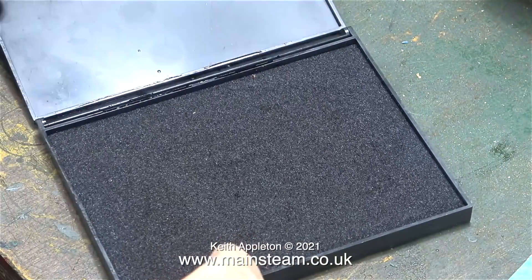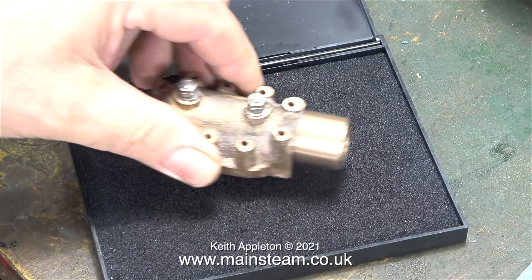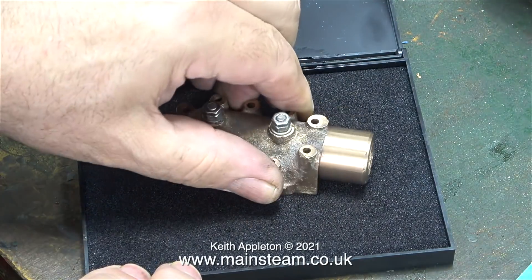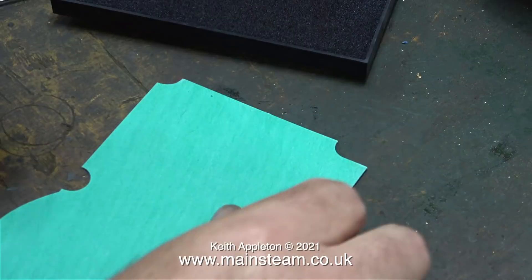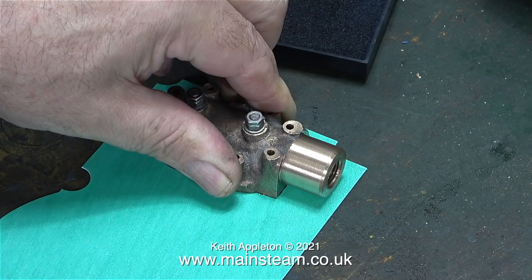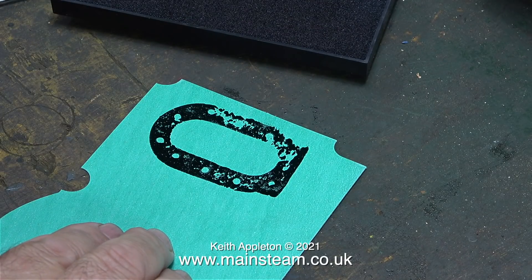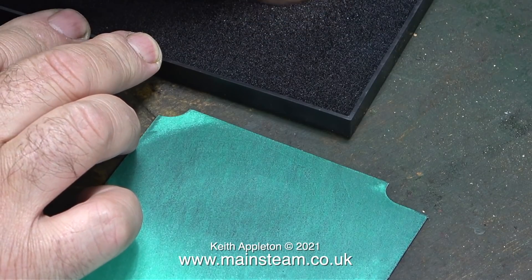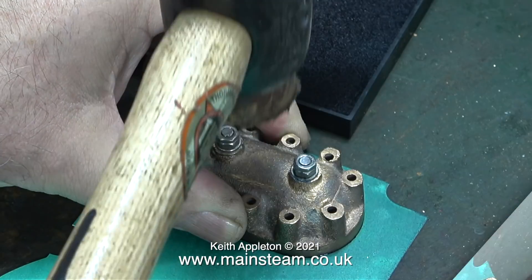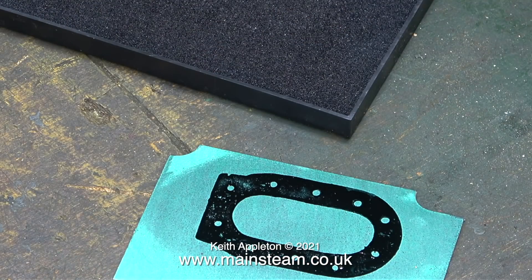It's time now to make a gasket. I'm going to use an ink pad to take an impression of the part I need the gasket for, making sure I get a good coating of ink on the part. All I then have to do is press it firmly down onto a piece of gasket material. Even though it was well coated, the image was less than spectacular — probably because my bench is uneven. I should have done it on a surface plate, although it's easy to put right. I wiped off the ink, repeated the process, placed the part back on the gasket paper, and tapped it with a hide-faced hammer. And now, as you can see, I have a perfect image to work with.